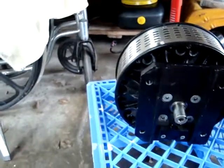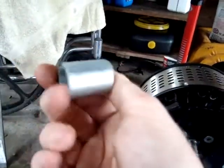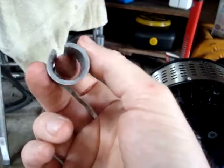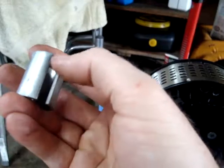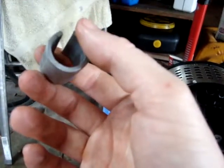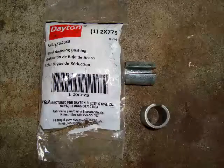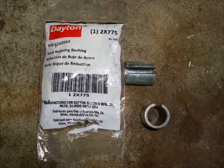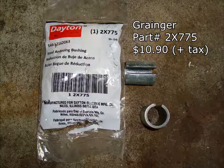So all that part's the same. The only problem was the inner diameter. Going back to the sleeve, here's one here — I was able to find these sleeves made for exactly this. The outer diameter is one inch, the inner diameter is three-fourths of an inch, and they come with a notch cut in them so you can slide a keyway in there. I went to a place called Grainger to get these — there's a Grainger shop in town where I went and they ordered them for me. Unfortunately, they come in a pack of three, and you have to buy the whole pack, so now I've got two extra sitting around.